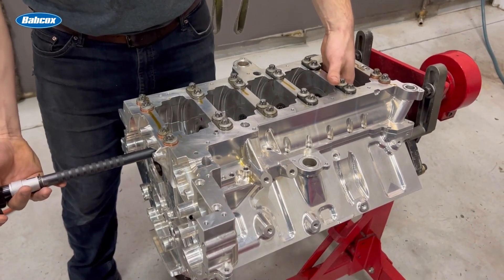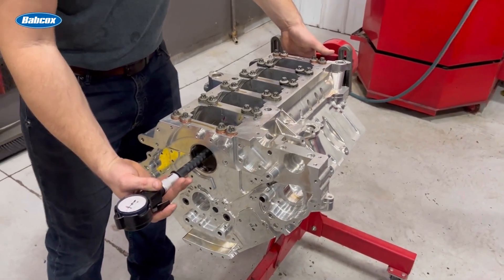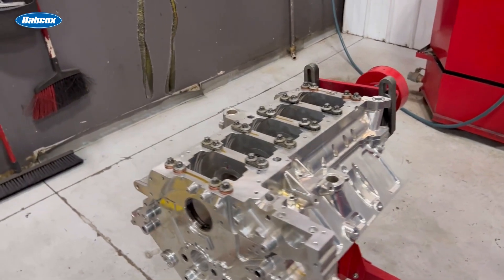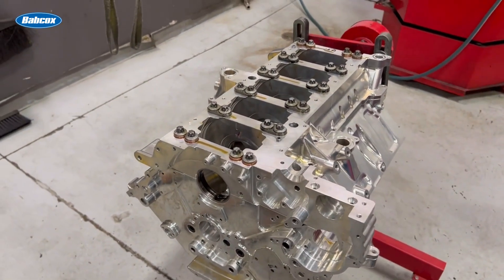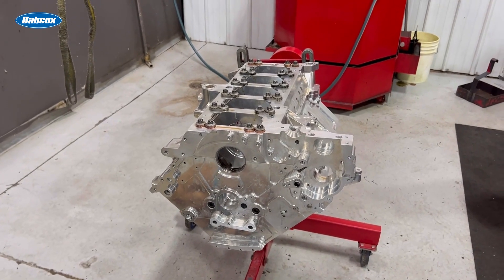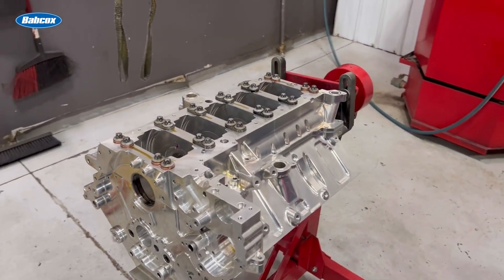I would calculate that since I can't get this block to 200 degrees easily, I'm not going to bother — we're already proving that it's growing and it's obviously going to grow more. What you have to think about here is: the problem with these Lamborghinis is that you are oil pump limited. It has a stock oil pump, and the stock oil pump is a big deal — it's not adjustable, and it doesn't have enough volume for these type of motors. The best process someday is probably going to be an exterior pump that will flow more oil.